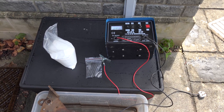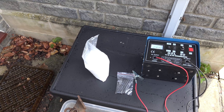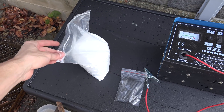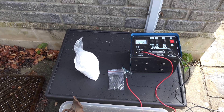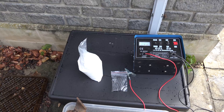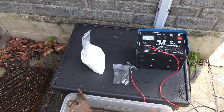The plate is going to be inside this tub full of water, and we're going to need something to provide ions so that the rust and bits can move around in the water. We'll use sodium carbonate - it's a good source of negative and positive ions so the rust removal works properly. This one's called soda ash. You can also use sodium hydroxide, which actually works as a rust remover on its own without electrolysis, but we'll try the sodium carbonate and see if that works.